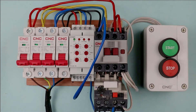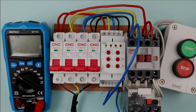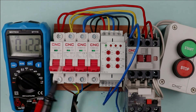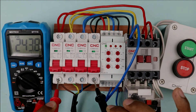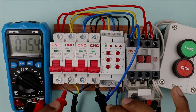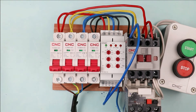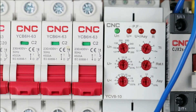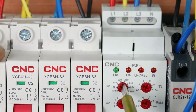Now let's learn how to use all the knobs and program this relay. First, set your multimeter to voltage and measure the voltage on each phase. L1 phase power supply voltage is 243 volts, L2 is 234 volts, and L3 is 236 volts. So we can consider the average voltage as 235 volts. With the help of this knob, we set the operating voltage, so I am setting this knob to 235.